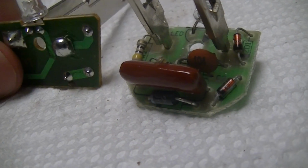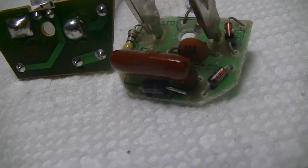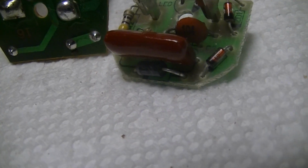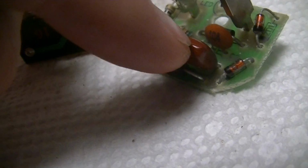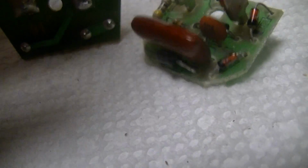The only real advantage of the resistive one is that it basically doesn't give a toss about the waveform as far as limiting current, and all it cares about is the RMS potential on the half of the cycle where it's conducting. This one, of course, running it on either a square wave, a modified square wave, or a pure sine inverter that doesn't have adequate mains filtering, which is the norm for a lot of the cheaper ones on the market.